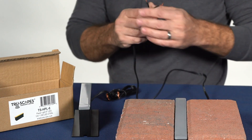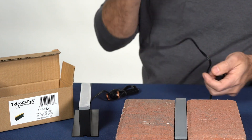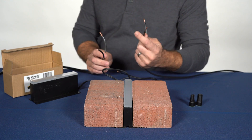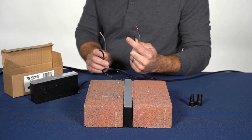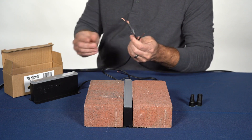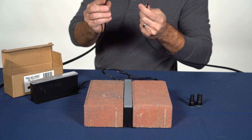Wiring is included as well as two wire nuts with every fixture. For proper installation take your 12 or 14 gauge lead wire, strip back the typical three-eighth inch from the rubber jacket to expose the copper. You will have two sets of wires, one in and one out.